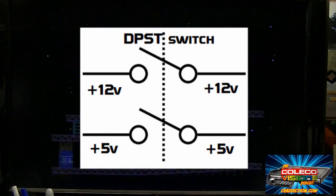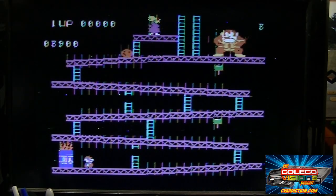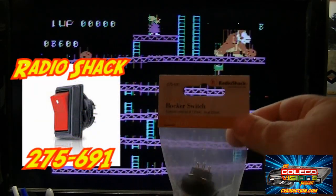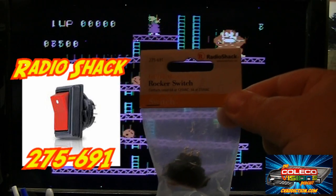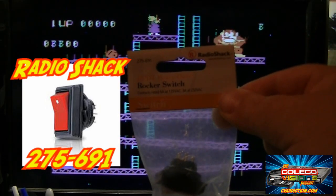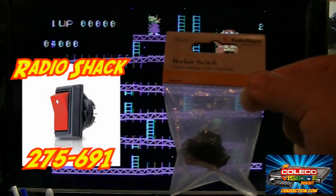So what we're going to do is, instead of cleaning the switch, which is one option, I'm going to install a new rocker switch. This is a Radio Shack switch, part number 275691, dual pole, double throw switch. So let's get this thing installed.